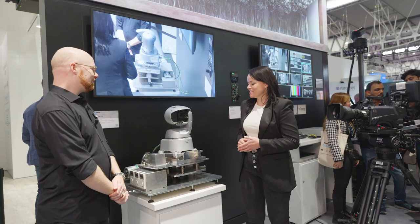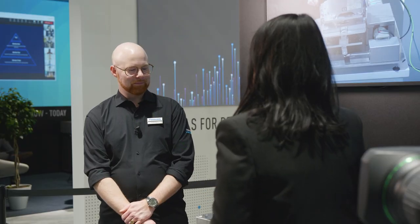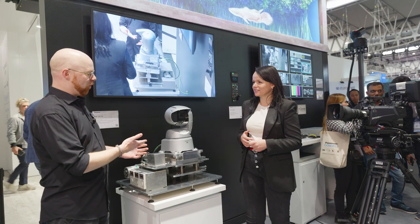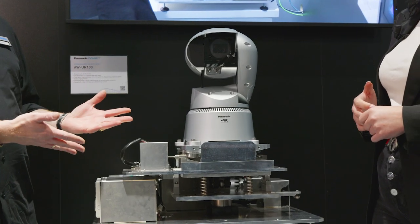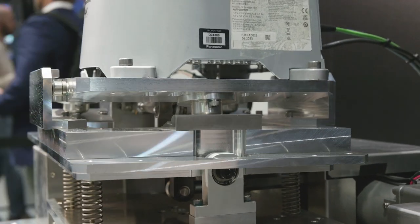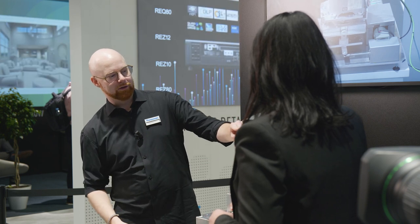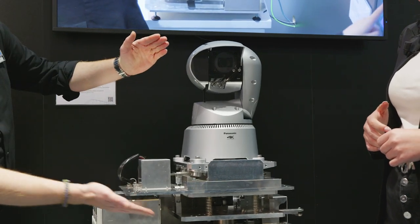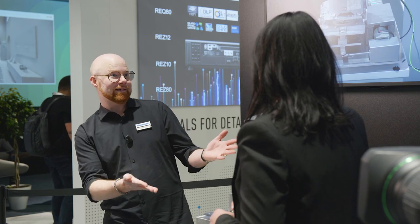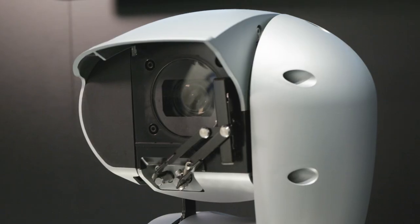Sounds like a superhero. This is a special setup — what is it for and why is it here? It looks quite strange, but really it's simple: the factory has to check for various elements that would influence our products. This machine can vibrate and bend in all directions, quite similar to an earthquake creating seismic movement. When we made this camera, you can see it moving because the ground is moving, and we are able to countermeasure every movement in the ground in the camera — that is called DISS. We combine that with optical stabilization and electrical stabilization, and we have a super steady camera.